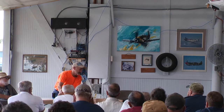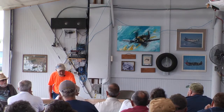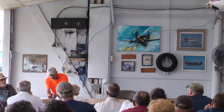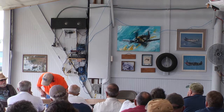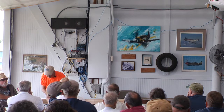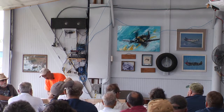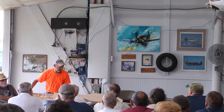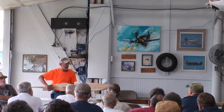So he took the chainsaw and he clamped it down really good to the corner of the table, and he would plunge the chainsaw in, making these series of wafer cuts like this, making absolutely sure that he kept his eye on that line at all times so that he never got close to it. And when you make your initial cuts, you need to stay about 1/4 of an inch away from that line on the leading edge and the trailing edge. So I usually try to cut the back of the blade first, which is the flatter side of the blade, like that.